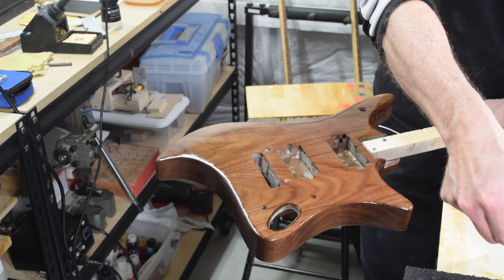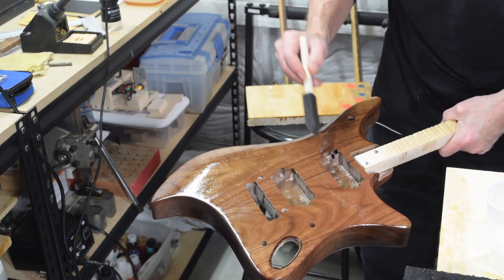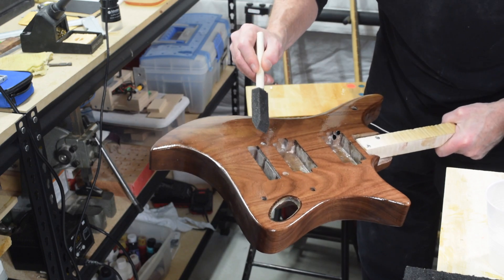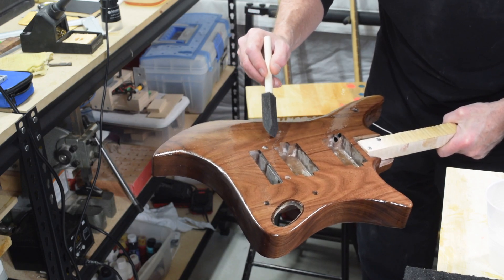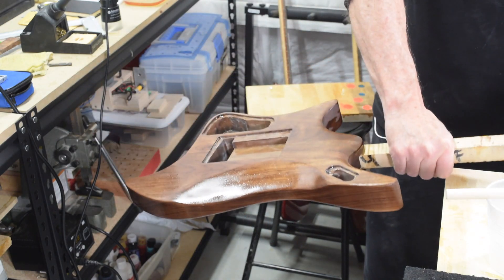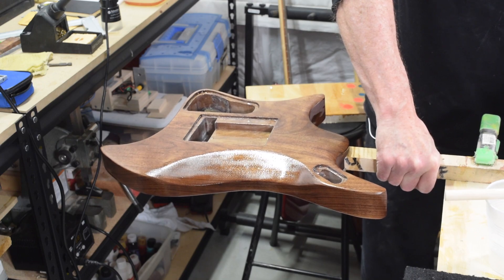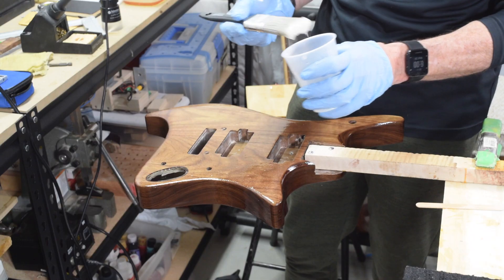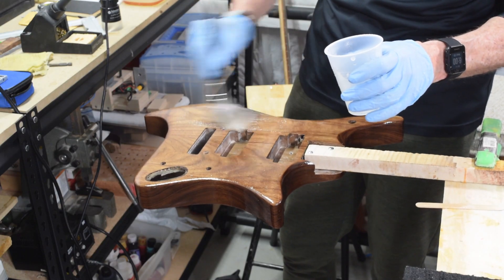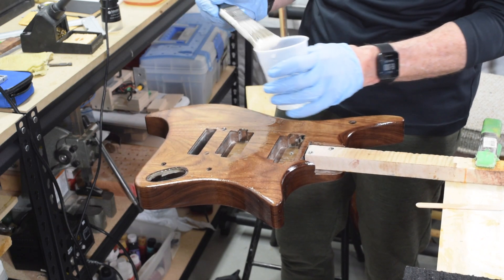During the first hour you have the opportunity to do any touch-ups if necessary — for example, if you see any dust, lint spots, or bubbles. I ended up flipping the body every 15 minutes for about two hours, and after about 90 minutes it had set up. Then six hours later it had fully cured to the point where I could apply the second coat.